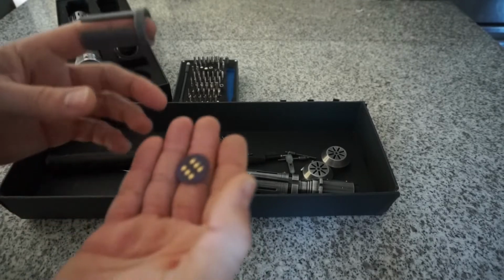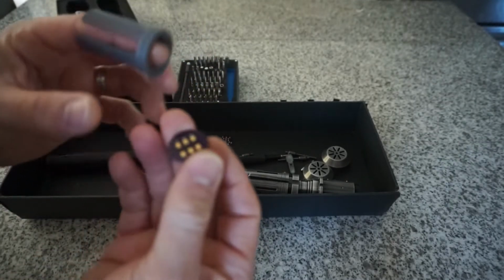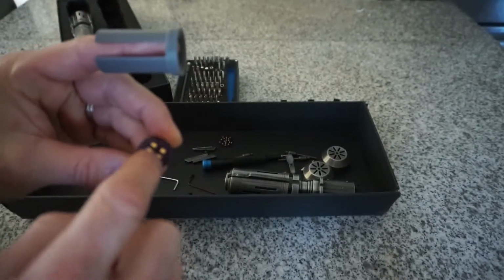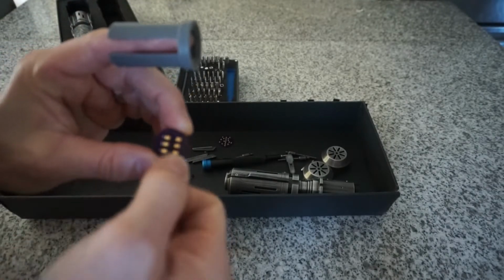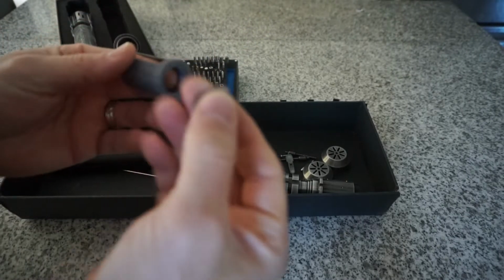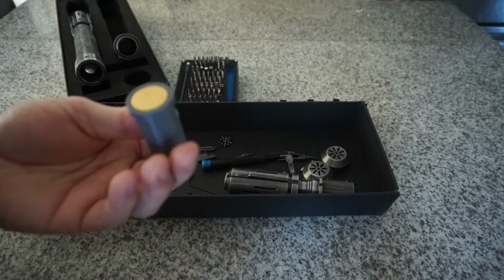But it's a good practice sometimes to put a little bit of hot glue on there, not to keep the wires soldered in place, but just to keep somebody from tugging it and breaking the wires. But that'll go there.